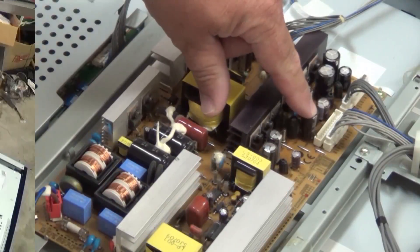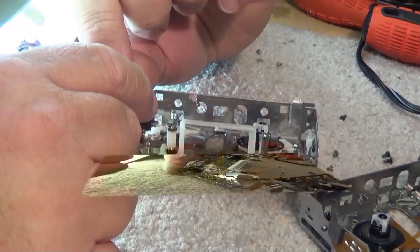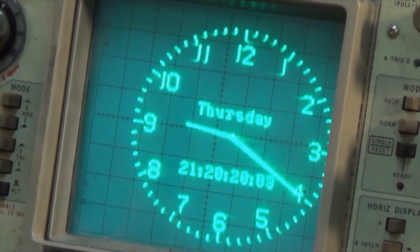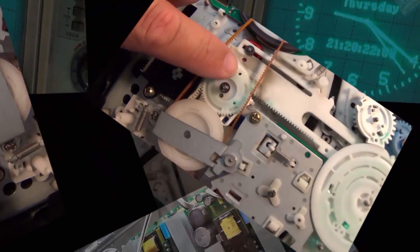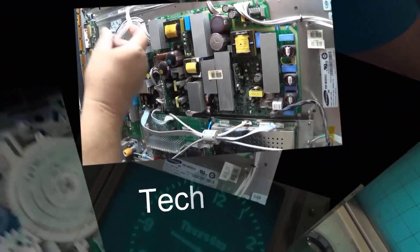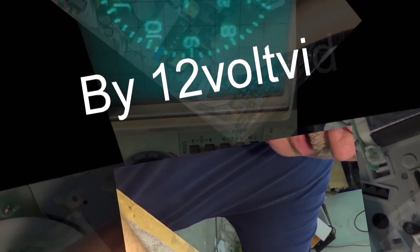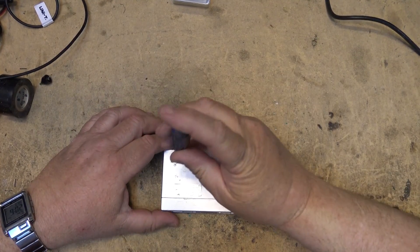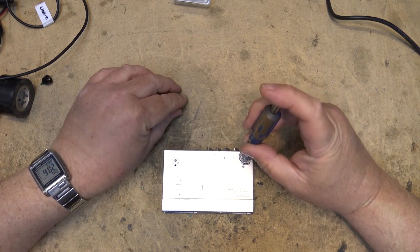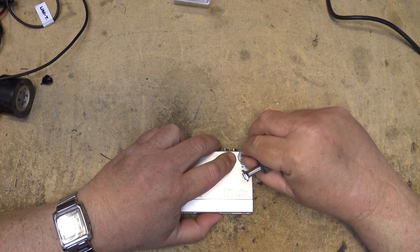In this episode I'm going to service an old Sony Walkman 10. This is the smallest full-size cassette player ever made and without a cassette closed it is the same size as a cassette in its carry case. It uses one AA battery. We know it needs a belt because we've looked at it before. We start by removing all these little screws and the volume control, and then basically we have to peel the back off to access the belt.